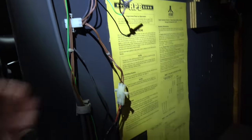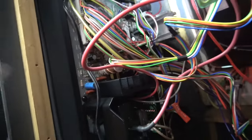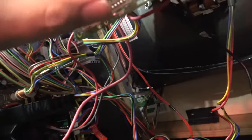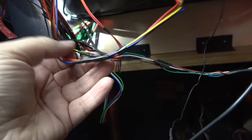I've tidied up the wiring and plugged in the power — I cut the plug off the original chassis power cable and connected the original plug to go into the power from the transformer. The Sharp Image chassis is variable voltage so it shouldn't mind what voltage I give it. Checking the work: we've got RGB in from the board, power coming in, the anode cap on, the neckboard on with its earth, and the main yoke wires in here — remembering these may not be right; we might get a reversed screen image, and if so we can change around the red and the blue or the green and yellow.